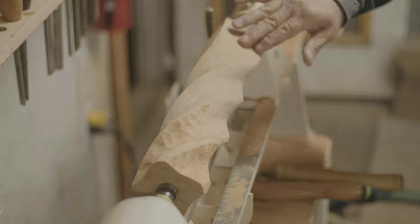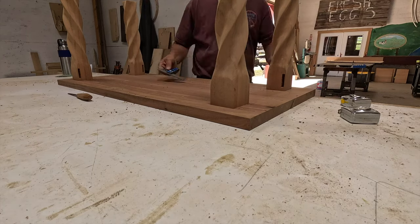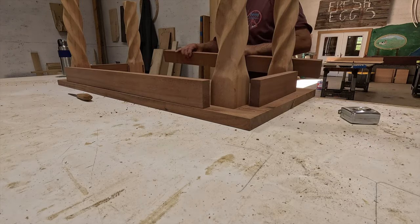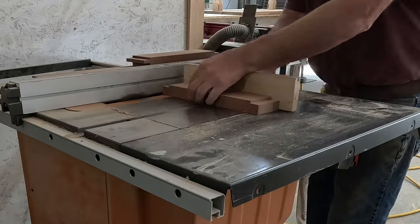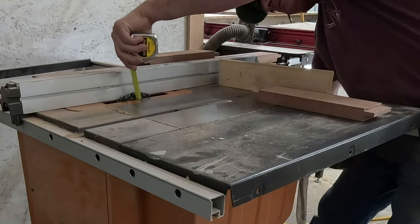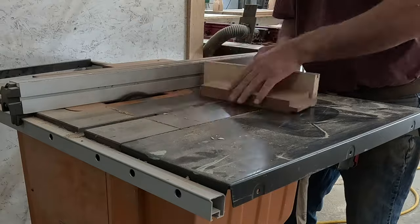So we're just building a coffee table here. I'm just kind of laying it out on the bottom of the table and trying to see the size I wanted. Now it's back to the mortise and tenons. I'd already done the mortises earlier, so all I have to do now is the tenons. Getting the tenons all made here on our dado saw. This is just a little saw we have set up just for doing dadoes — it's dedicated just for that so we don't have to keep changing the dado head.